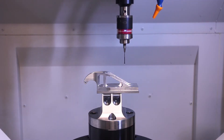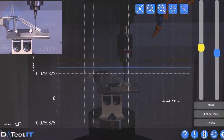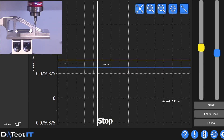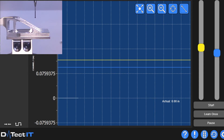The machine tool is now positioning the scanning probe to scan the surface. The analysis was started by the CNC. As the probe scans the surface you can see that it's already exceeded the under limit or the low level, and it also was lower than the upper limit. Basically the scan is showing that it existed within the parameters or the tolerances that were specified by the user. If either had been exceeded, an alarm would have been generated to the CNC control informing the part program.